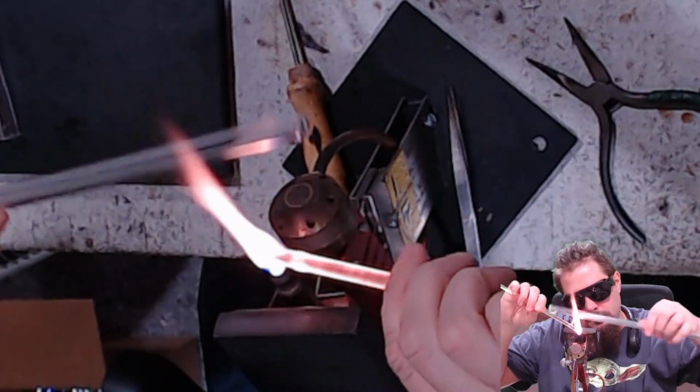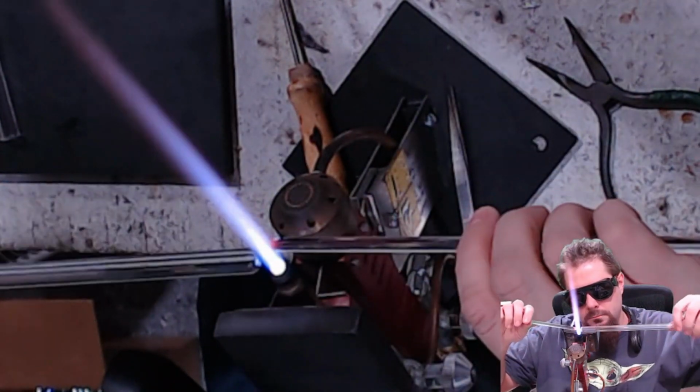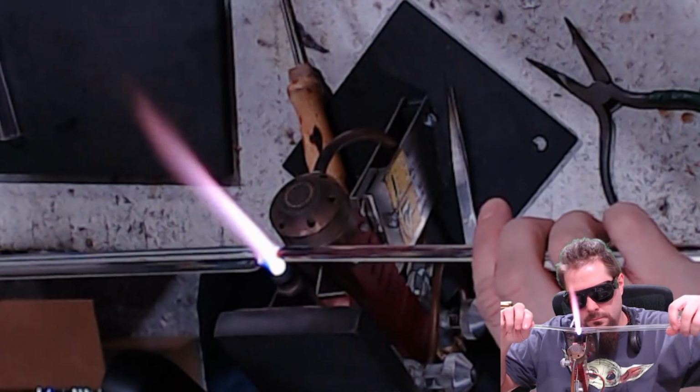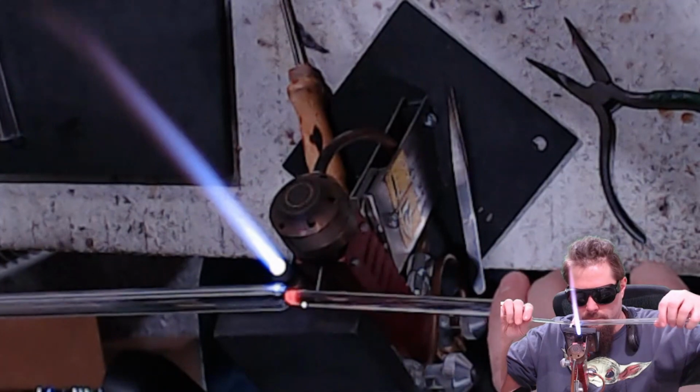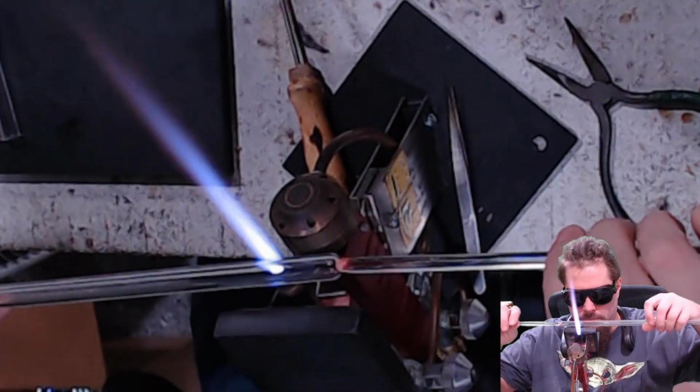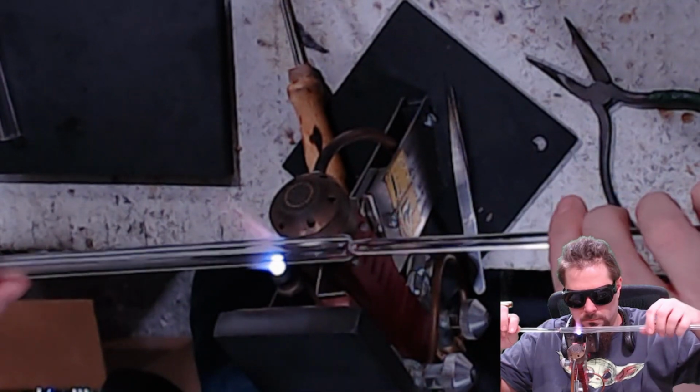Now, you could do a cold seal, but you'll see that I push a Maria for the lip part, and there's times where I've been shaping the Maria and had the cold seal crack off. That's really undesirable, so I just go ahead and do a full seal because it doesn't take much time to melt off. And I've got to pop a hole right there anyway later.